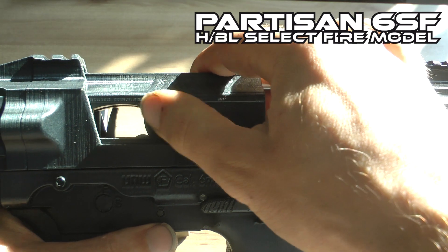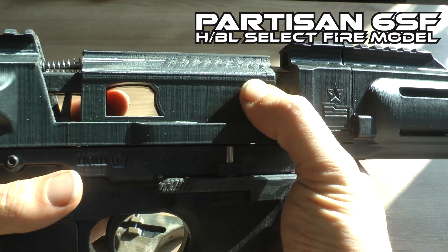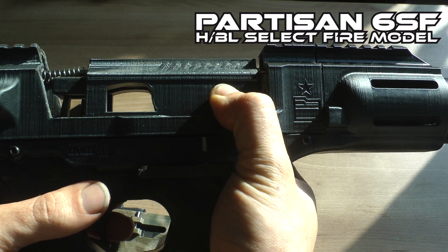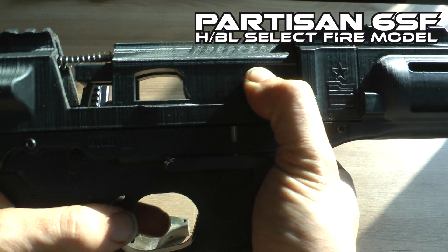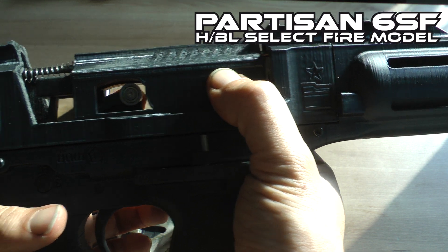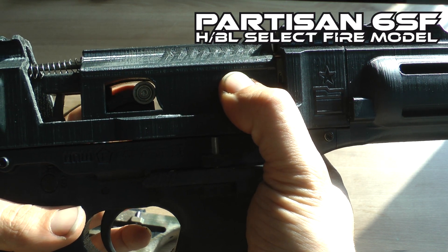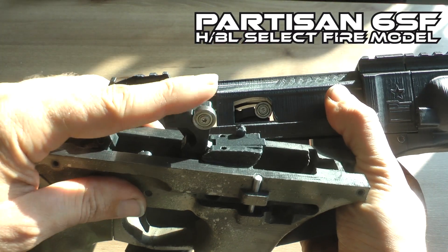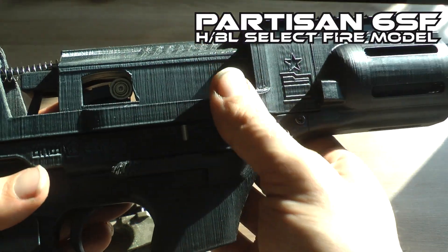There's no longer any chance that the bolt is hitting the arm and bouncing it loose — that was a beta phase issue. When the bolt bounce weights are not working, what happens when the bolt is closing is that it will bounce open a little bit. But the signal for the hammer to fly up is when the bolt is closed. So the hammer will fly while the bolt is already bouncing back slightly, hitting the bolt while it's still a little bit open — acting like a brake, killing the hammer's momentum, and meaning it cannot depress the valve in your magazine properly. That's why the anti-bolt bounce mechanism is really important at those fast speeds.